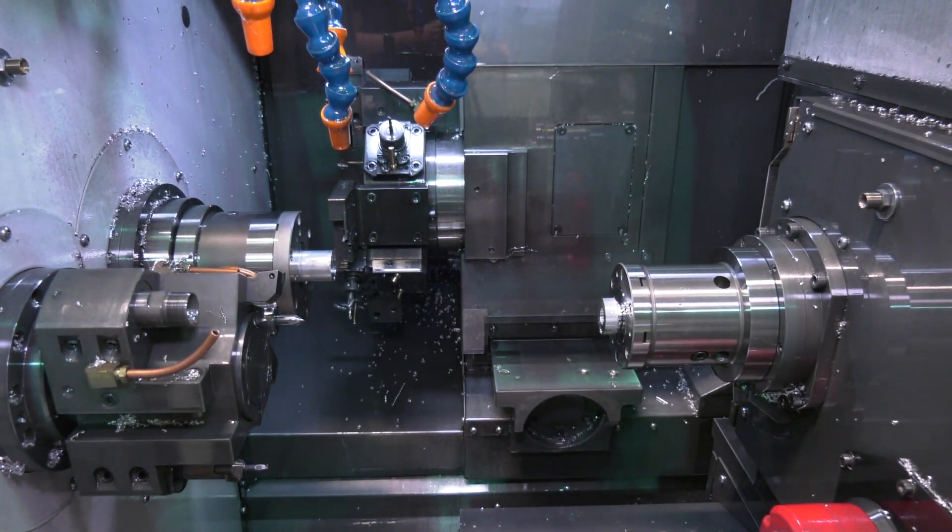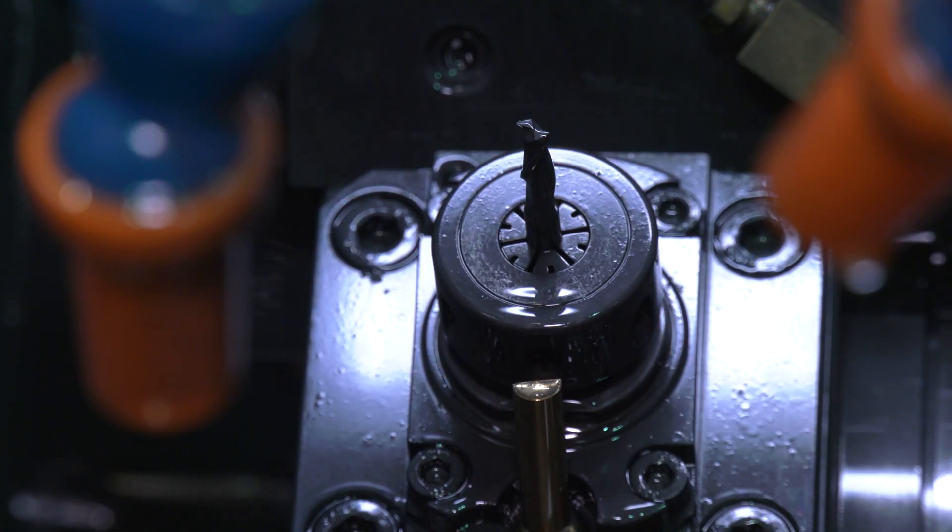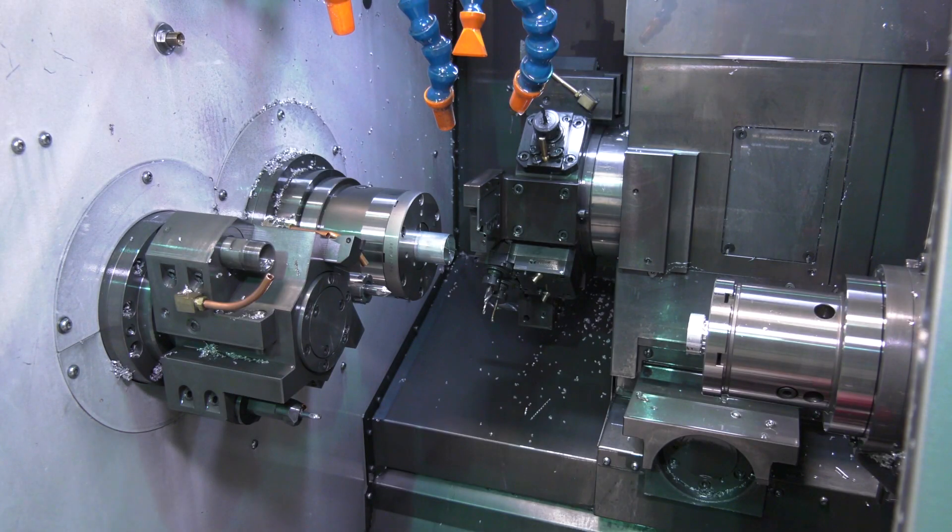So you can do your milling, your drilling, your turning — whatever that might be. You've then got your sub-spindle, which is actually working as a sliding head. Then there's the second turret, which is fixed but will index around. So that gives you a lot of flexibility to make those complex components.